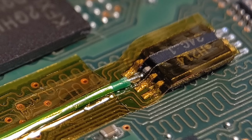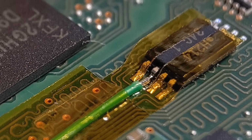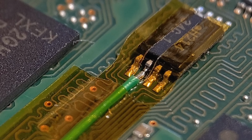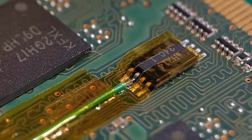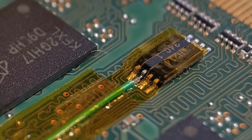You see the solder nicely attached all the way down to the base of the pad. So that's what you're looking for. Even if I would have laid it onto the pins next to it, the solder wouldn't have taken to them, thus avoiding the short. So like I say, laying Kapton on the pins either side of the wire can give you great results.